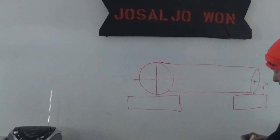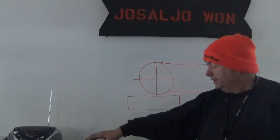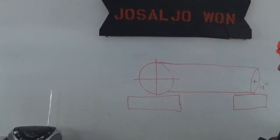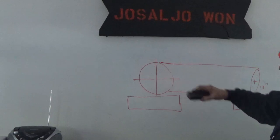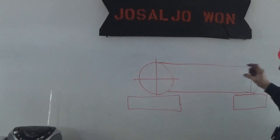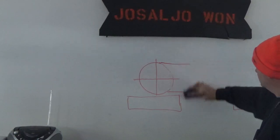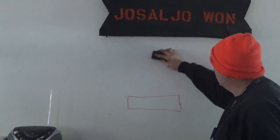You're trying to find the center of the tree. And why would you want to cut lumber and not worry about centering the pith? To get more lumber. Because sometimes if you center the pith and the log is off like this, you lose lumber out of the log. That's one of the reasons you want to center the tree instead of centering the pith.